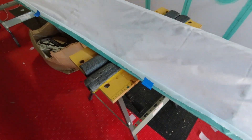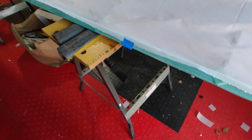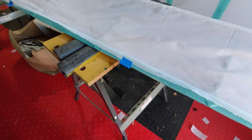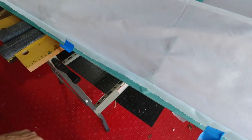I'm going to shrink the fabric first, and after I get it shrunk, then I will glue the rest of this. It would be a little difficult to do it while it's saggy, so I really don't have a choice — I've got to shrink it a little bit first before I can actually glue that down. Then I can final shrink it after that gets glued in place, going over the whole thing again.